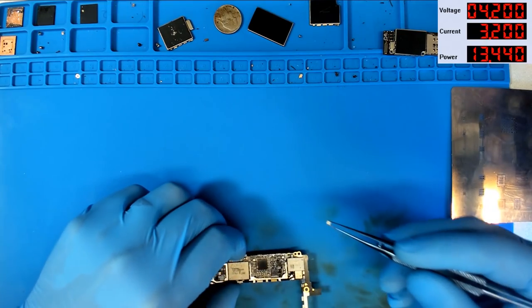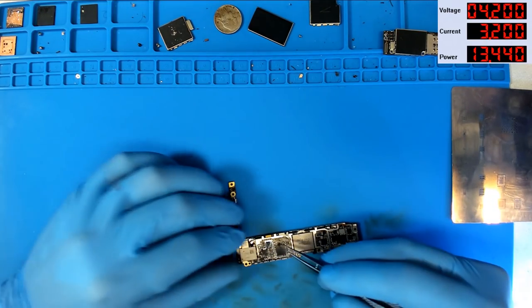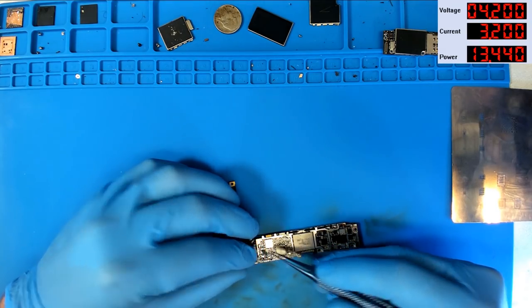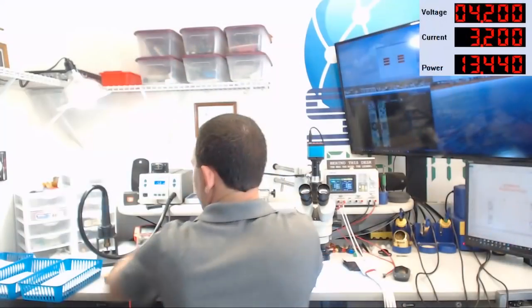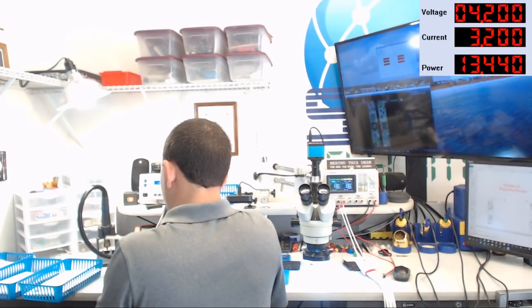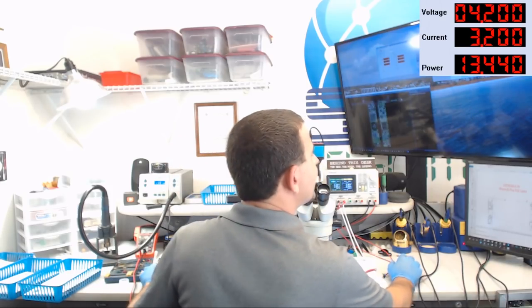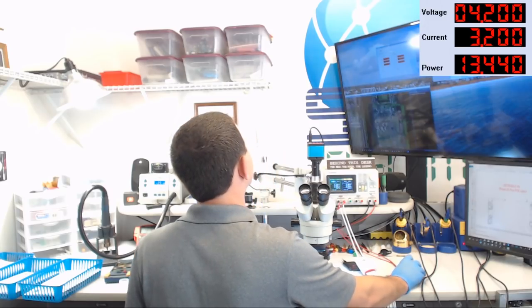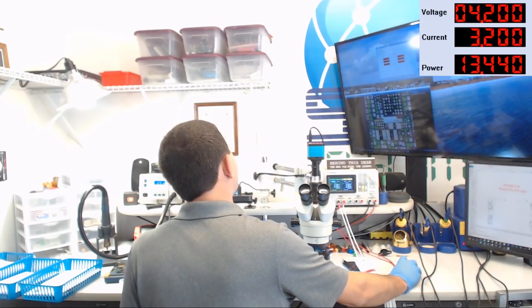So here we've got our customer's board. I'm going to sit this Chestnut IC right here, right about where we need it. And then what do I have here in the way of brand spanking new caps? 6.3 volts, 2.2 microfarad. What is the value of these caps? Shall we look and see? Because we're missing some here that I feel like we should have.